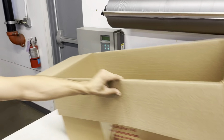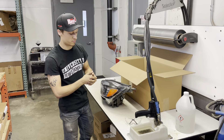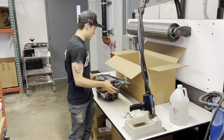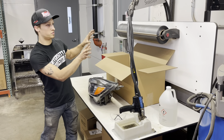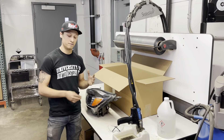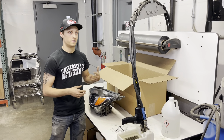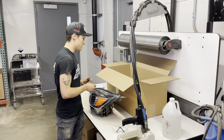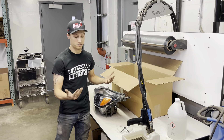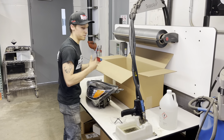The process for headlights with the foam machine is essentially the same whether it's tail lights or even smaller fog lamps. We typically only use this when the part is rather expensive — our cutoff for headlights is $500. We will typically always foam a headlight over $500. Even mirrors can be foamed — a mirror over $300 or $400, we're going to end up foaming that. Same thing with really expensive tail lights.